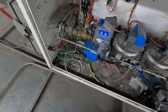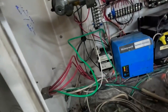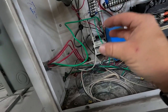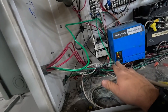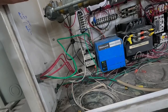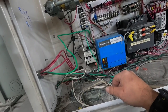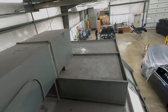Took a little longer that time. What I did on that igniter spark box down here — I used a screwdriver, grounded it, brought it to it, pulled it away — used an insulated screwdriver and all that happy stuff. No issues with that. I hope to goodness that's what it freaking is. Let's go see whether it's in bake or what's going on.